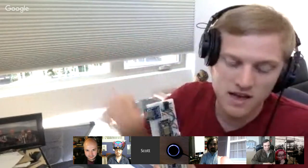Like I said before, they broadcast this strong video signal constantly, and everybody you fly with has a slightly different frequency so that you don't clobber each other. So the idea with the timer is that it's a data logger. It logs the RSSI of the video signal over time, and when you fly past it, that's your peak. So you could time yourself for laps by detecting the time between peak to peak.